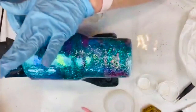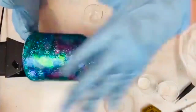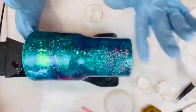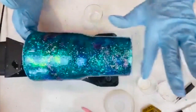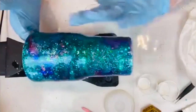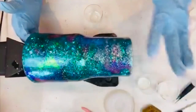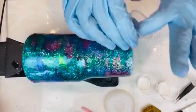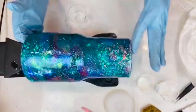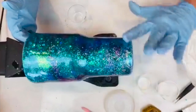Before doing this, we went through it and just sanded off the small little bits that were sharp, little sharp edges, but we didn't do anything aggressive. We just very gently sanded on the tops of anything that was really sharp. But I didn't even try to sand down to a super smooth surface, because I knew that this next coat of epoxy would take us to that smooth surface. So I just knocked off the sharp little bits and the ends.